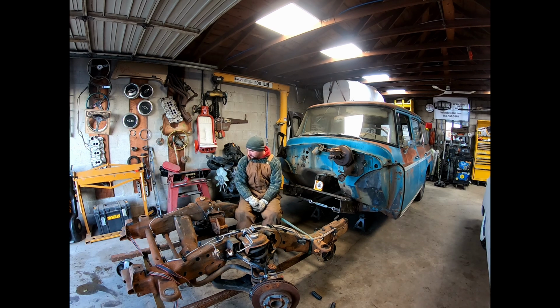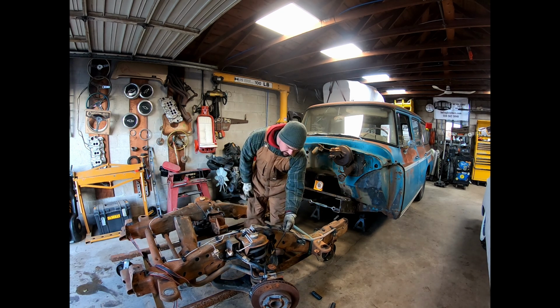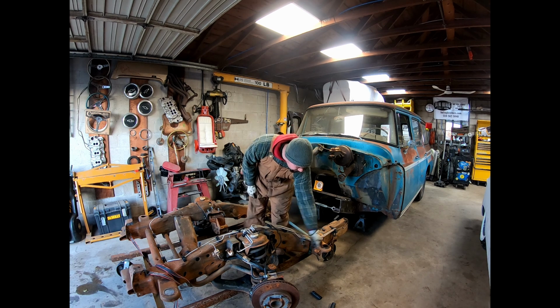I think first thing I'm gonna do is clean up some of the stuff off this. These old brake lines that used to run to the rear. I'm actually gonna save the front ones because we may be able to tie into them or get them to actually reach the master cylinder or proportioning valve, I mean. So we may not have to re-bend those. So we'll keep them, but some of this other crap, we just wanna get it cleaned up.